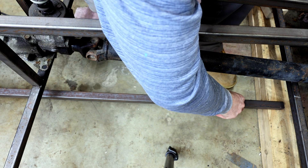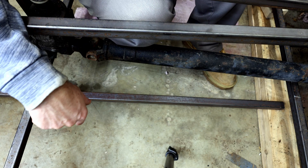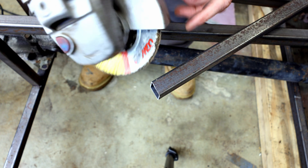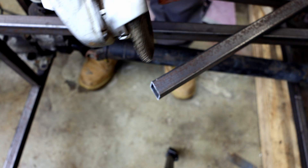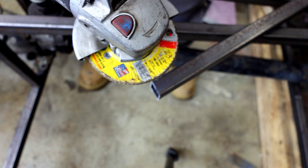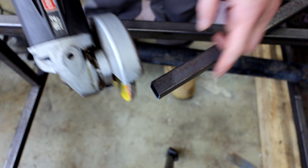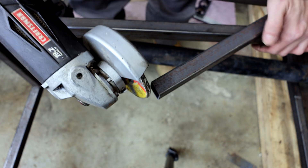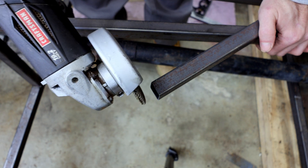Fabricating with square tube is much easier than fabricating with round tube. Here's the tube — it's a little long so I'm just going to use this flap disc. This one is 60 grit; these come in different grits. When you're trimming the length of a tube down you want a 60 or 40 — it makes it work more like a grinding wheel than a flap.